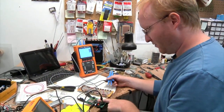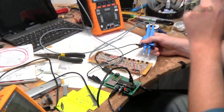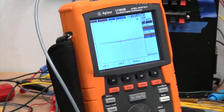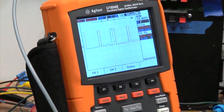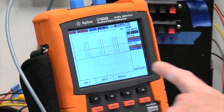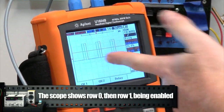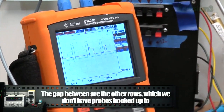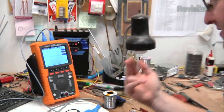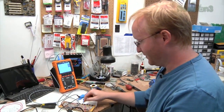I've got my little development board for the Propeller here and it's driving the Johnson counter. The oscilloscope gives a good demonstration — I can hook up the first two lines and see them on screen. One is triggered, then the next, then the next. It counts down, telling the display which row to activate using only two wires: clock and reset, resetting after the first seven.